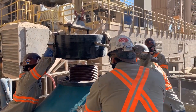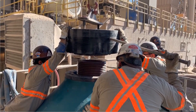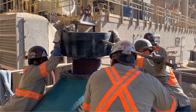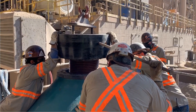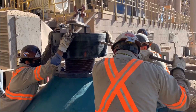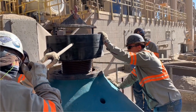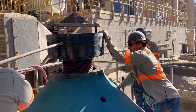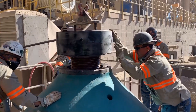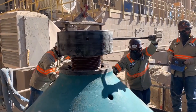Then with the crane, you will carefully lower the crusher nut into place, getting ready to thread it on. Keep a little tension on the crane while you're threading the crusher nut in place. Line up the threads, turn it, and you'll notice that as you keep tension on it, just a couple of people can use pry bars and get the crusher nut down where it belongs.